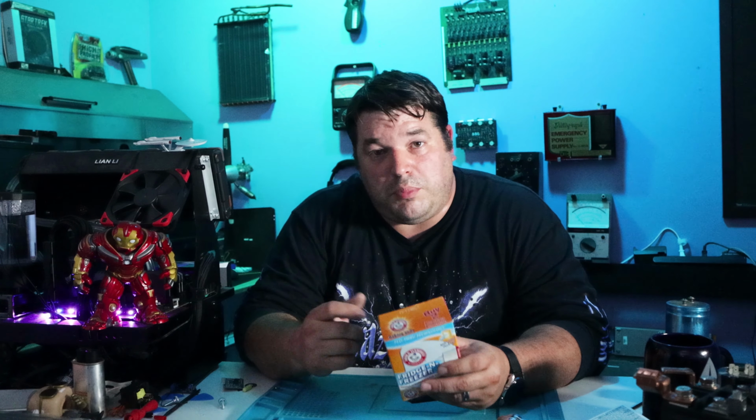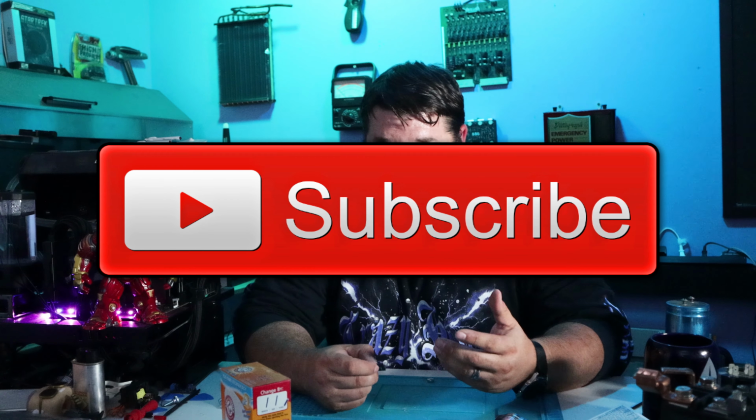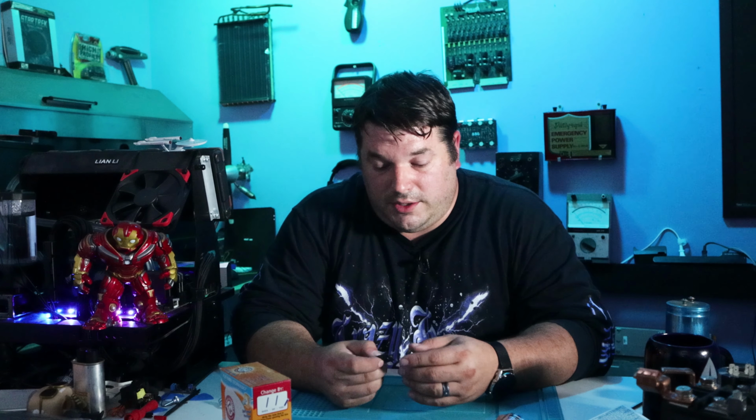All right. Now, to explain myself a little bit here, super glue is called cyanoacrylate glue. And believe it or not, baking soda acts as a catalyst. It makes it dry faster. Yes, the already fast drying cyanoacrylate super glue will dry faster if you sprinkle some baking soda on it. What brings this about is I have a piece of plastic that needs a repair. And I believe I can make this repair using this technique of super glue and baking soda, because not only does baking soda make the super glue dry faster, it also acts as a reinforcement.